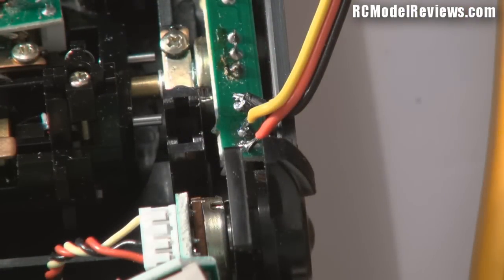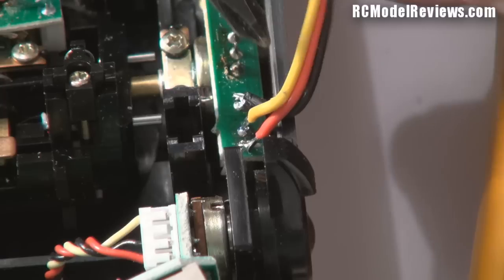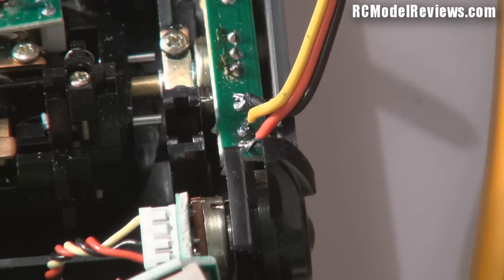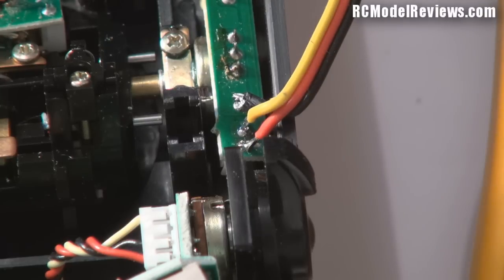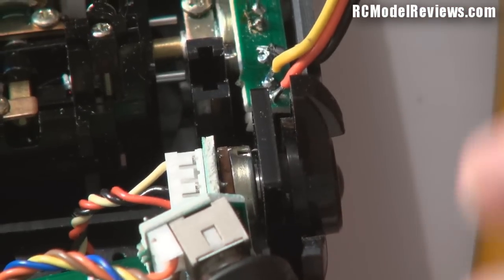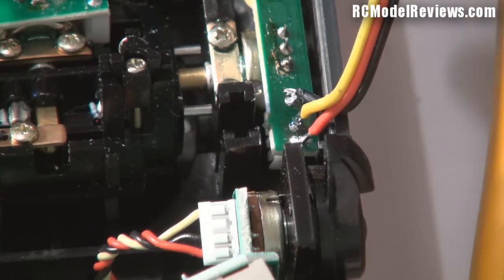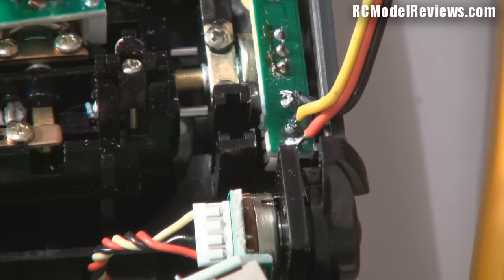Because it's hard to hook up connections to these small pins, I've soldered a little bit of wire onto the pot pins so I can hook up my meter. Moving the pot lever shows a change in resistance as expected, but that doesn't tell me much. So I'm going to hook it up to the oscilloscope and see whether the voltage on the center wiper wire remains constant - that will tell me if there's any noise affecting the aileron channel throws.